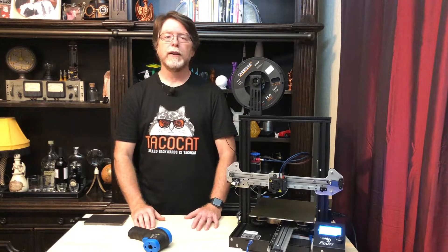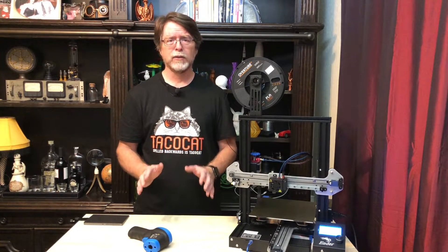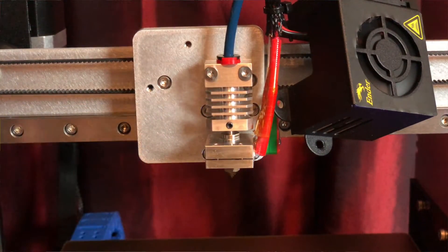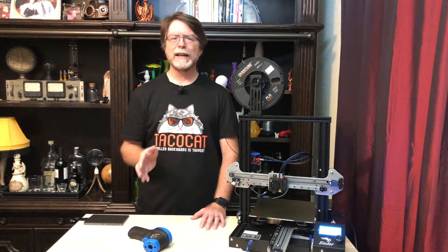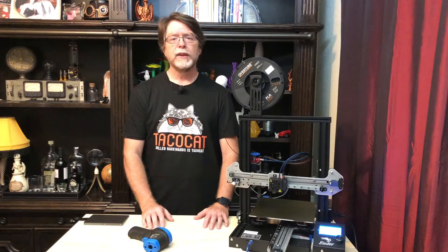Originally, I got this unit because I wanted to try to verify the temperature of the heated bed and the nozzle of my 3D printers. And while it's amazingly accurate at reading the temperature of the bed, it is very, very difficult to get a reading on the heater block at the nozzle. The heater block is usually shiny, polished metal. It may have an insulator around it, such as ceramic wool and Kapton tape, or it may have a silicone sock. You can't get an accurate reading through the insulator, so you need to remove it — pull the sock off the hot end. And you remember that mirror analogy about how shiny reflective surfaces like the polished metal of the heater block are hard to get a reading on? While you can put tape on the heated bed if you have a reflective surface, you can't put tape on the heater block. That just leads to bad smells and the possibility of a fire — a nozzle at 230 degrees C is about the same as Fahrenheit 451, not only a sci-fi classic but also the flashpoint of paper, so that's definitely not a good idea.